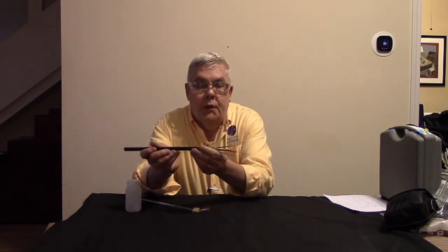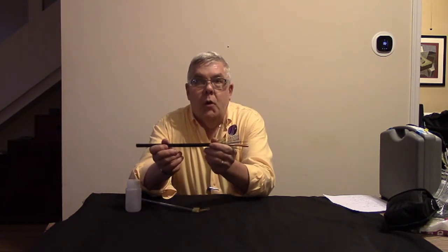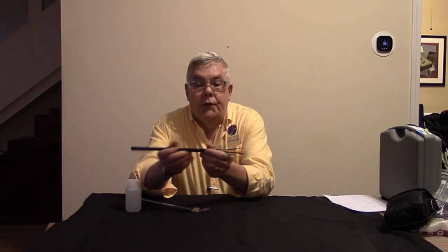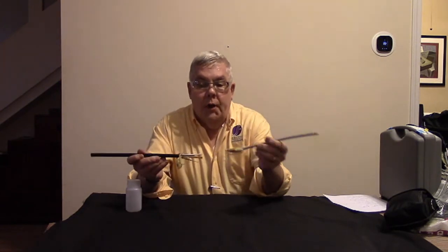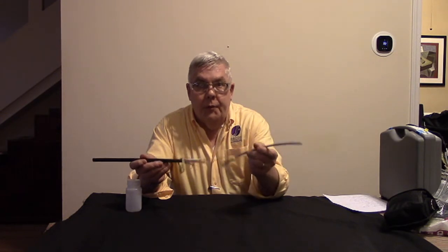The third reason that fusion splicers get used is sometimes we're bringing a heavy cable like this one, this outdoor cable, into a building from another building, and we need to transition it onto indoor fiber. This cable is illegal to install in a building. This cable is legal. So at some point we have to hook these fibers up to these fibers. Typically this is done with fusion splicers, and the splices are put into a splice cabinet, which I'll show you in just a bit. But this is another reason to use a fusion splicer.